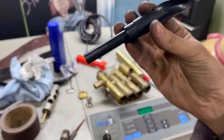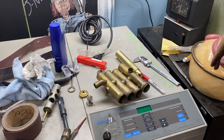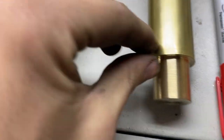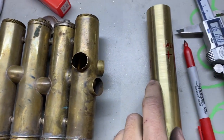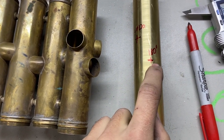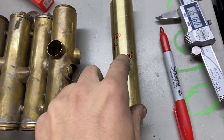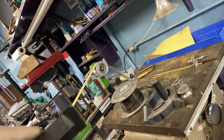Luckily I got a reduced shank drill for the mill. I'll use a half-inch spot and just go through with it. We'll draw out these holes and try to get the mill set up — maybe we'll do it tonight, maybe not. Just scribed it off the bottom reference. There's my connector — kind of like this, side by side. There's the connector, there's the up-120, and then there's the 180. And then there's the other up-120. These are just approximations so that when I'm drilling on the mill and dialing in my correct angles, I know I'm on the right track. See how ballsy I'm feeling because this is a $70 piece of brass.